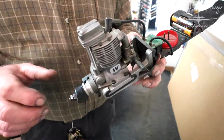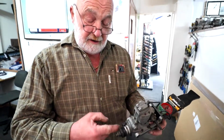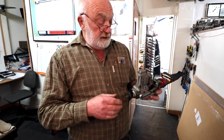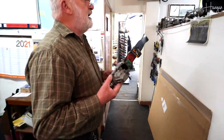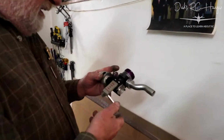That is crazy. And that draws 200 milliamps. You get no spark up to 50 RPM. From 50 RPM to 4000 RPM, you get 3 sparks within 1 degree of crankshaft rotation. And then from 4000 up to 60,000, you get stuck with 1 spark. That is phenomenal. It'd blow my brains. There's people that watch this, they're going to be loving this to bits.